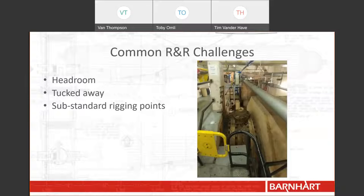In this photo, you can see a butterfly valve at a dam with very little access. More importantly, how can you remove it? There doesn't seem to be anything apparent that we could rig to, and there also doesn't seem to be anywhere to lift it from. Could we lift it from below, or should we add some lifting lugs to the top of the valve?